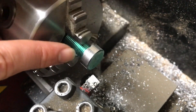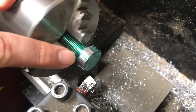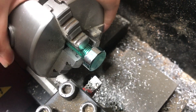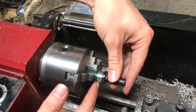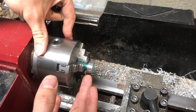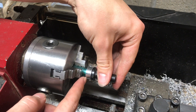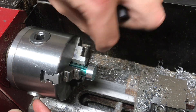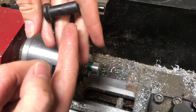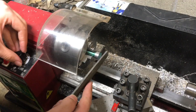We're getting pretty close. You can see this entire half is all a circle — it's easy to see because of the green spots. This diameter is a little smaller than I wanted it to be; part of that is because of the wobble. The bigger the wobble is, the more you have to go down. I want to keep this thickness here — I don't want to take that down yet because I'm going to be grabbing onto that. So I'll do that last. I'll flip it around, cut this diameter, and then flip it back around to do that. I always like to deburr before I take it out.